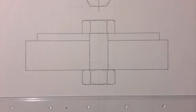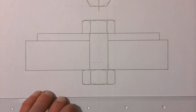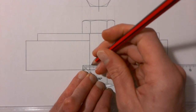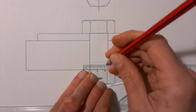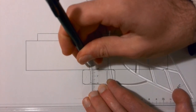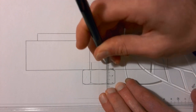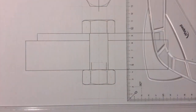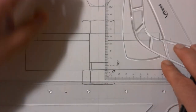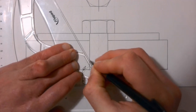My thread is meant to end on that construction line I've drawn. Because this is a sectional view, I'll be able to see that bit of thread on the inside. I'm going to mark off my thread size, which is 0.1 times my M value, on both sides. Then I'll draw in my thread up until that line — the end of my thread where my thread length ends — and then I'll put in the 60-degree lines to show that my thread tapers off.